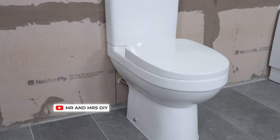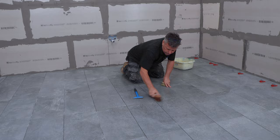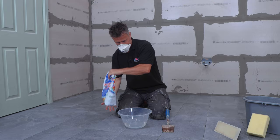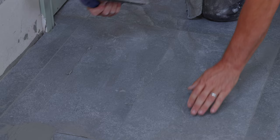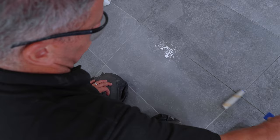In this 60-second tip I'm going to show you how to seal porcelain tiles and then grout them. Start by scraping and cleaning off any tile adhesive that may be on the surface of the tiles. Then add your pre-grout treatment — pour it on and roll this across the surface of the tiles with a roller, a brush, or a light handheld sprayer. Then mix your grout with clean cold water — add the powder and give this a good stir. Wear a dust mask; this is the consistency you're looking for. Then start to spread the grout in between all the joints going from left to right, making sure there are no air pockets. Then scrape it off the surface. Once this is semi-dry, start to buff the tiles off using a wet sponge — do this every 15 minutes over a couple of hours. Once the grout is completely dry the following day you can apply the sealer on it again, covering the grout.